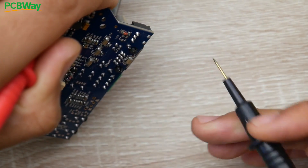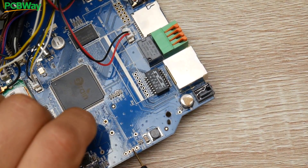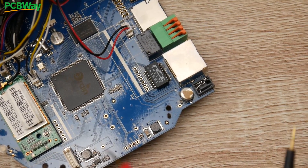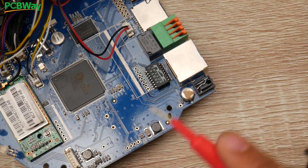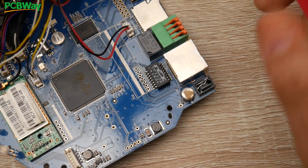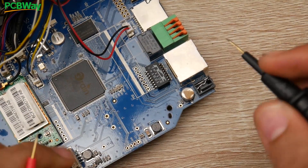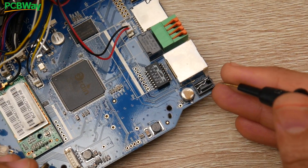So that's where we're going to solder our first wire. We can solder the ground directly to the barrel leg, or completely ignore that and just solder to the GND pad right here — any ground pad would work. The slightly harder part is the five volts. On the picture we saw that the pin was five volts, and that pin has broken off.